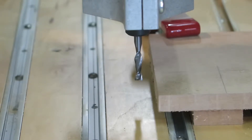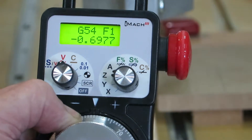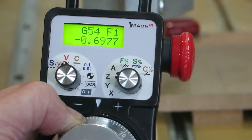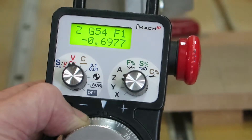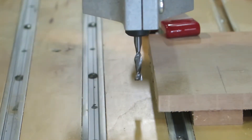You'll need controls for this. In Mach 3 there is a manual pulse generator mode you can use, or you can purchase a small numeric USB keypad that acts as a kind of pendant control. If you're lucky enough to get one, you can also get a manual pulse generator made specifically for Mach 3. I've got one hooked to my machine — on the top are the coordinates, then controls below that, and the actual wheel that controls motion is right about where my thumb is.